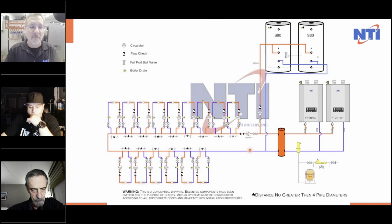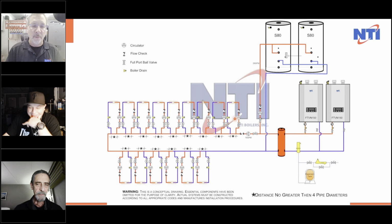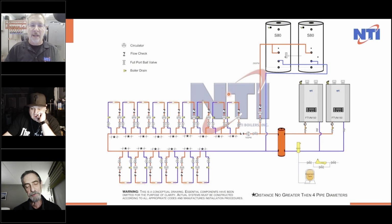He saved mixing valves. We had somebody chime in that says, oh, that should be a high temperature loop and you should have 18 thermostatic three-way valves in. And folks, you can crucify me all you want, but if you want to use a thermostatic valve, forget it. You can use that for a bathroom. If you're going bigger than that, let's be serious. Let's get some real controls in there, because the pressure drop across a three-way thermostatic valve at 2 gallons a minute will increase the size of your pump dramatically. So please, if you're thinking of using thermostatic three-ways.